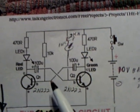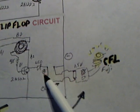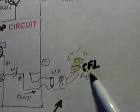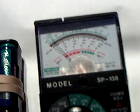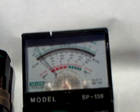I did a bunch of different things, but I hooked it right up to the JT circuit. And then it went from the JT circuit on the voltage bump to the Fuji camera CFL and ran that. That runs off of AA. And I ran it off of a solar panel today using these nickel metal hydride batteries — that's about 10 volts there.